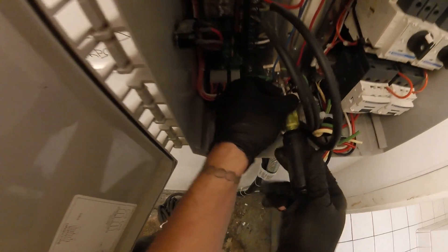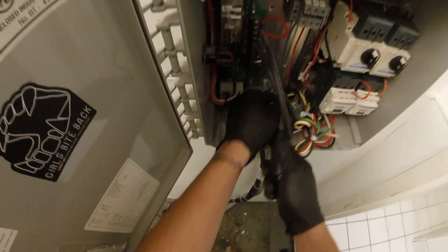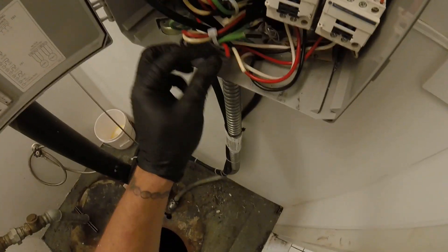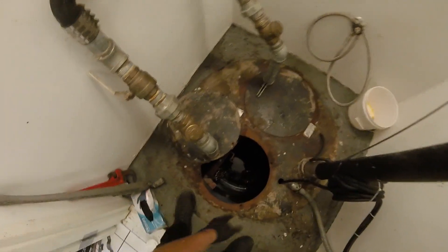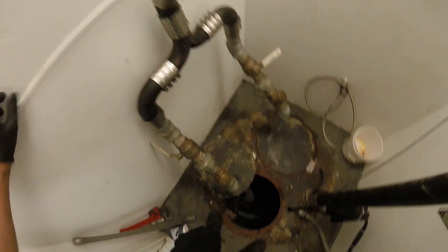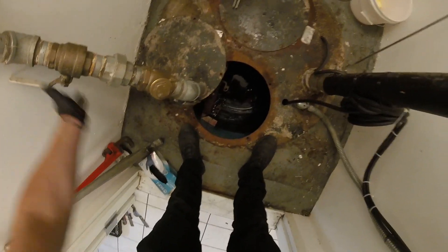That's our ground. Just tie-wrap these off to the side, cut off the end — it's not going to be used anymore. Here's our three wires; hopefully we're going the right way — this is three phase. Just kind of straighten that out a bit, got to close this up. We actually just tilted it to the side and worked around it. Got to tighten down this union, this valve is open, and let's test the pumps.